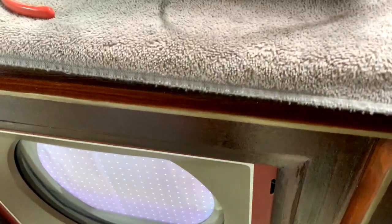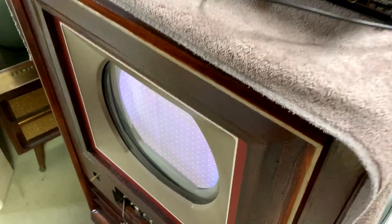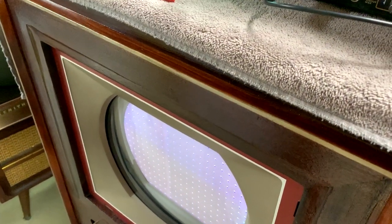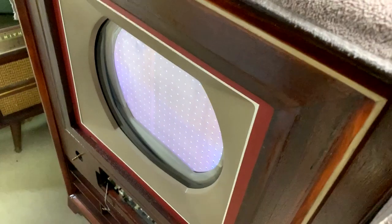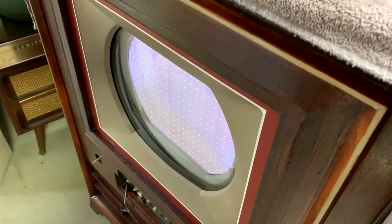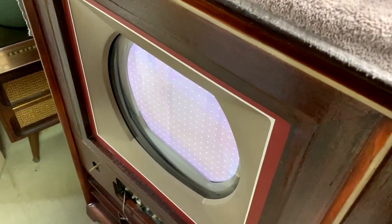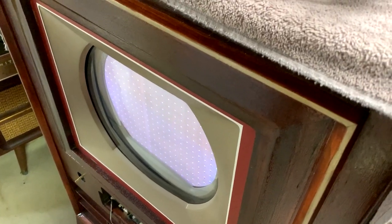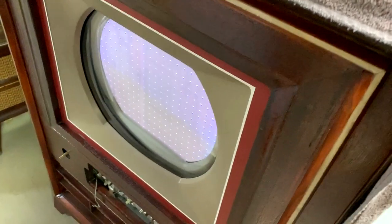Now I have a rock-steady 19.5 kilovolts. Before, the voltage was going all over the place with brightness levels, but after I put the new shunt regulator in — it was actually too high initially, so I turned it down — it's been fine. The only other things I've done so far were grayscale and a few other adjustments. My RFAGC tube, the 6AN8, was actually bad — it was delaminating inside.